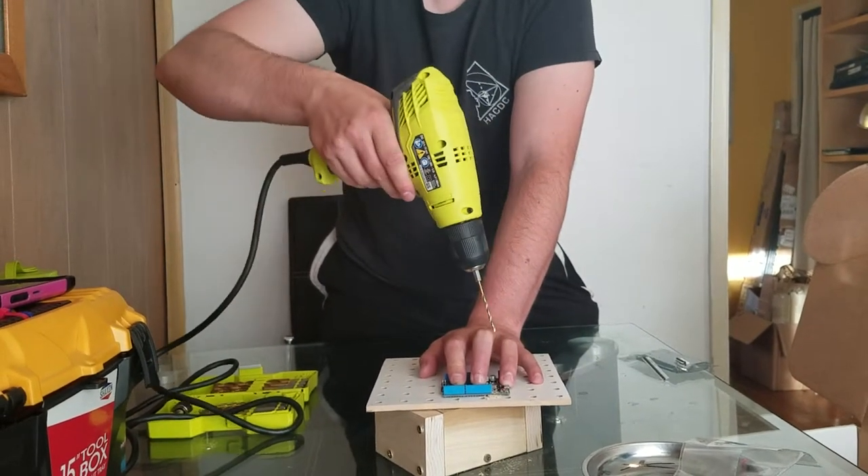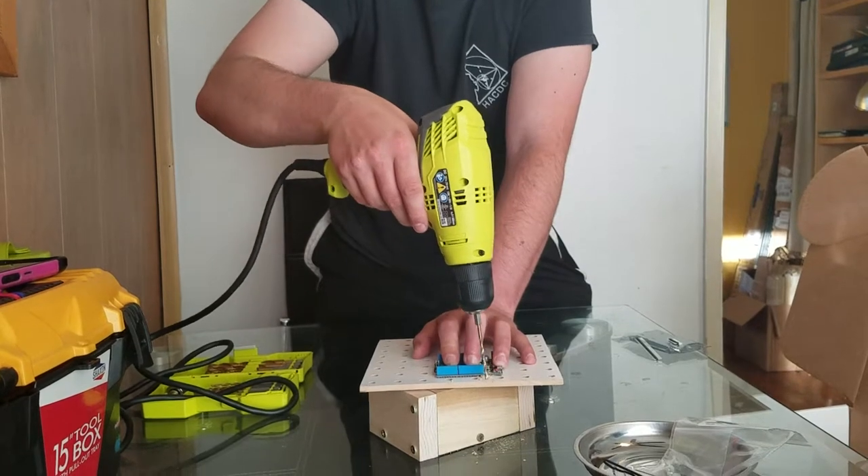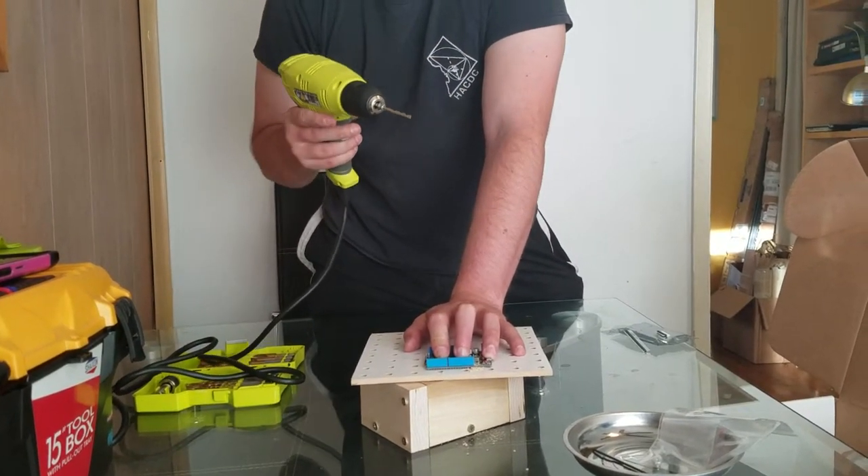Also, I keep holding the trigger. After I've gone down, I keep the drill bit moving fast while I pull up. That makes it a lot easier to pull it up, and it also makes it less likely to break.